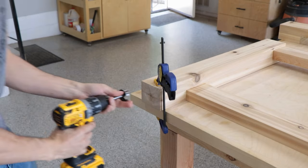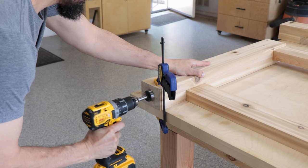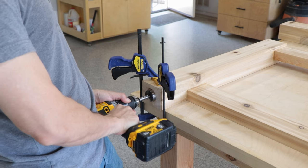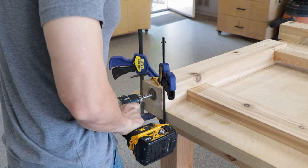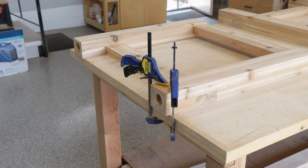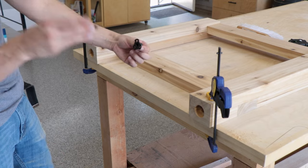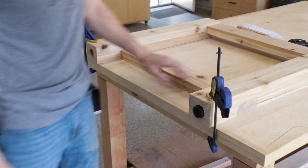After that dried, next up we're putting in the holes for the leveler feet underneath. This is a good example of what not to do with a Forstner bit — I had a pretty large bit and didn't have the piece clamped down well, and it was jumping all over. Once I held it better it was too late because that little center piece was so loose it wasn't self-centering anymore. On the next one I did much better — good clamping and two hands on the drill — and it went in well. The center holes hold a bolt for the leveler feet, which keeps the table off the ground and not directly exposed to the surface underneath.